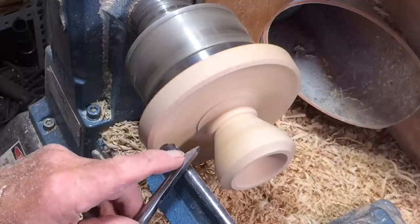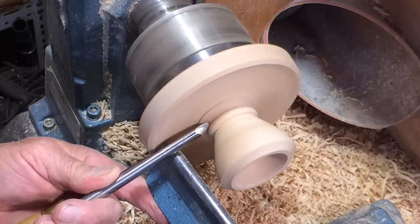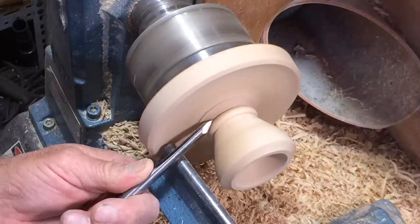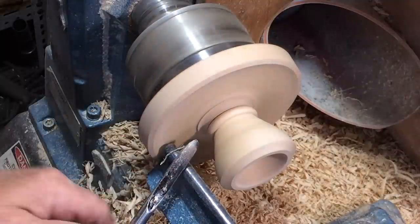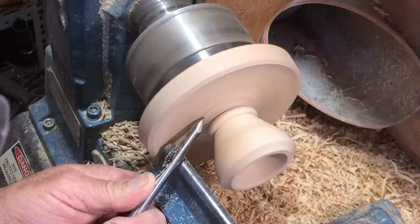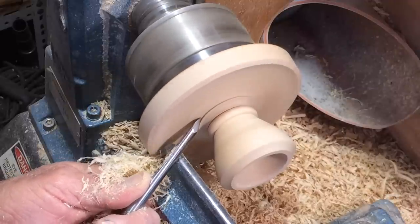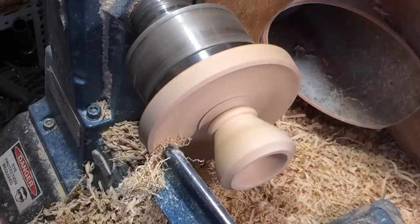Haven't got a long enough bevel, whereas this is the 3/8. Longer bevel. And that's just right on its side. I've really just defined the bottom of the bead, and then I've used the whole of that wing just to do a cove, and then I'm going to undercut that very slightly and then open the tool up slightly and just drag it back.